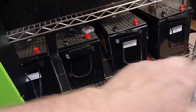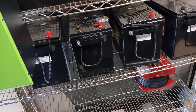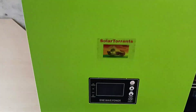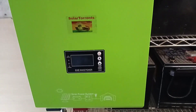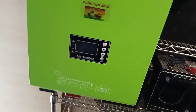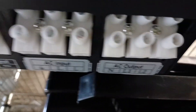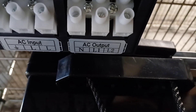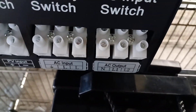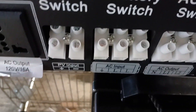We're going to have two sets of four batteries making 48 volts. We have our Solar Torrent inverter — found it on eBay, paid about $600. It's only 3,000 running watts but it has a 9,000-watt surge capacity for 10 seconds. The good thing is it's split phase, so I'll have 240 volt or 120 volt. We're looking to run a 240-volt well, which right now I run on a 3,000-watt generator, so this should be more than adequate.